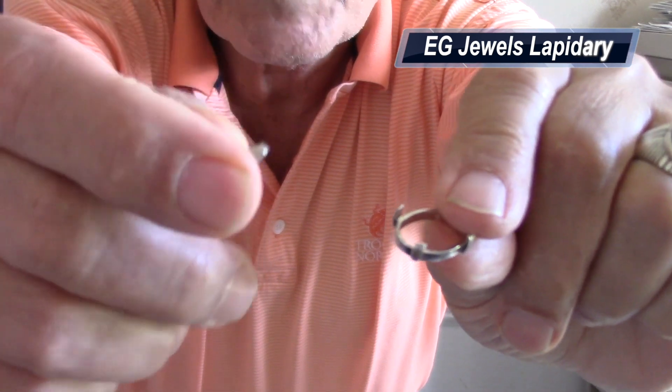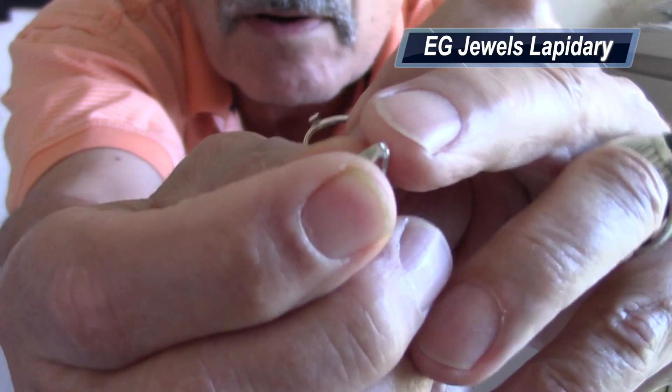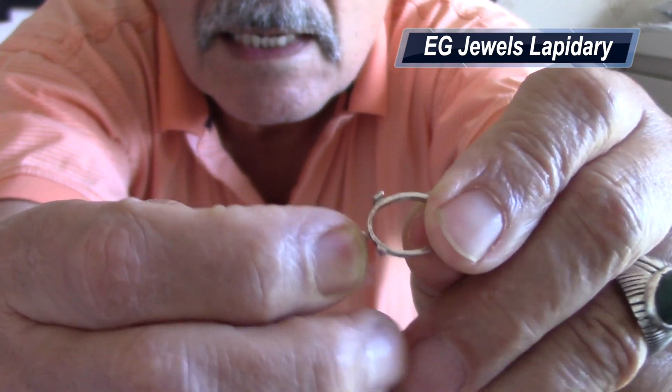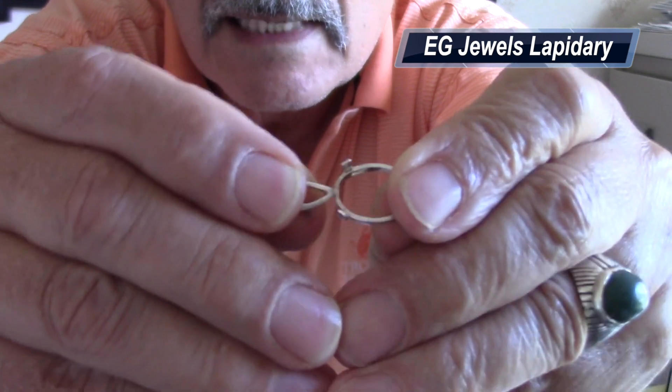In this video I'm going to show you a bezel — something similar to that. Here they are. You can see that's the bail, and the bail is very small. You can see the tip of it, it's very tiny — see that? — and it's going to go into this one here. So when I put it like that, it's a point that is touching where I have to solder. Watch where I'm putting my flux. So two things: the amount of solder that you're putting in, and the flux — where you're going to put it. Stick around, I'll be back in a second.